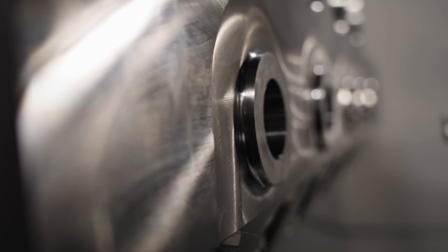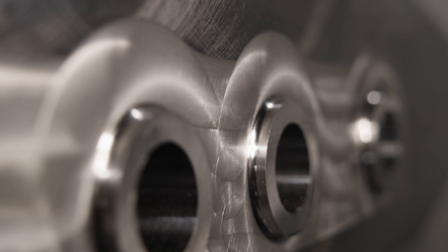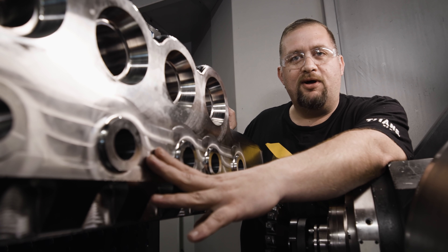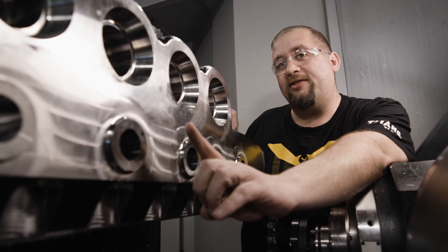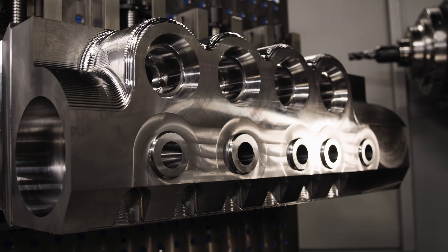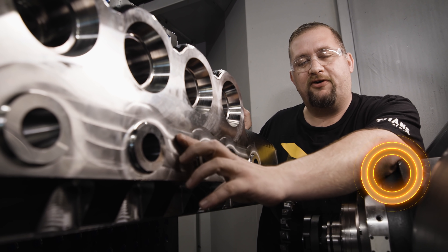I'm really happy with the way these surfaces came out. We got very little mismatch between our two different tool paths. This is really where years of experience comes into play. We backed that end mill off by a thou and rather than coming back and taking a thou off of our tool, all we did is rerun it in exactly the same position and it ended up taking that 5 tenths out and giving us a perfect blend.